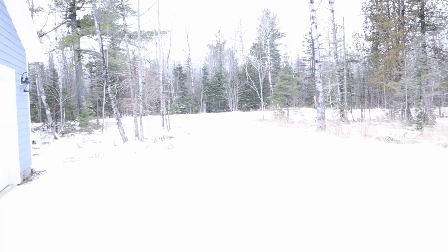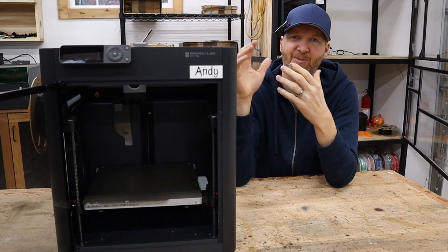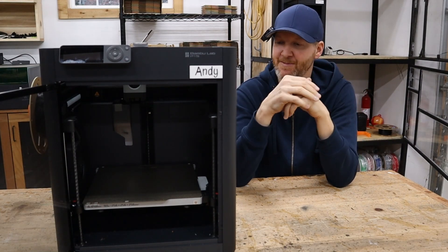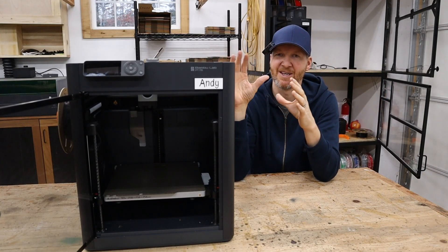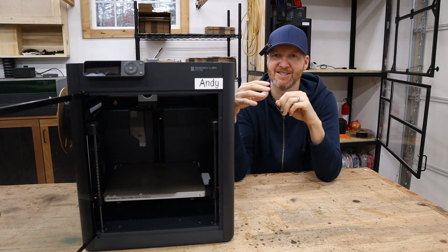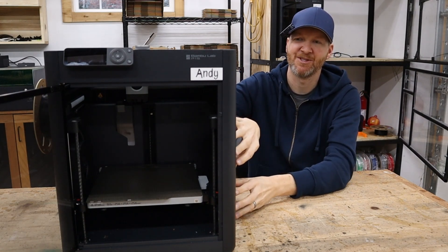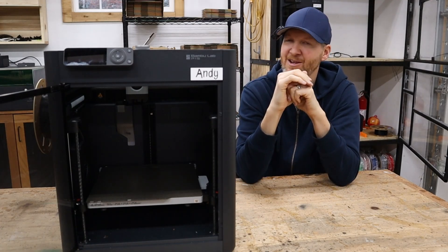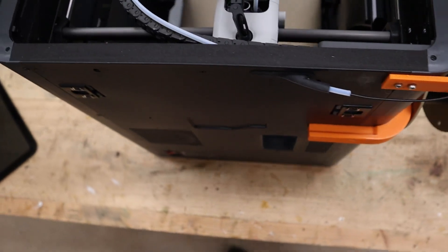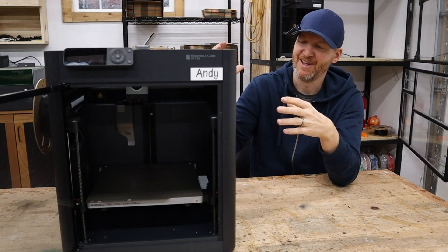I live in a cold climate and my workshop is not heated 24/7, so the enclosure is often cold. I have a big propane wall-mounted heater to heat the whole shop, as well as small electric space heaters to heat the enclosure itself. I try to get my custom enclosure up to 50°F before starting, and then the machines take over — the heated bed keeps temperatures nice and constant throughout the print. I was also concerned the filament on the side would be too cold going into the machine, but the tube inside the machine lets the filament warm up gradually before hitting the hot end.